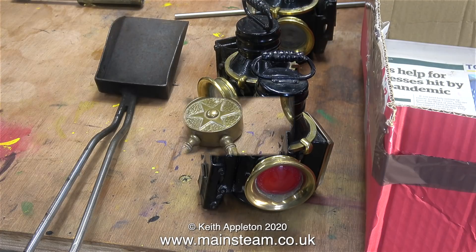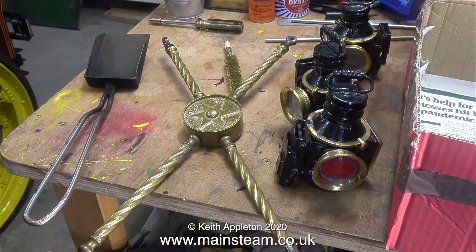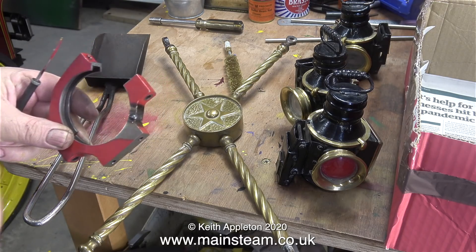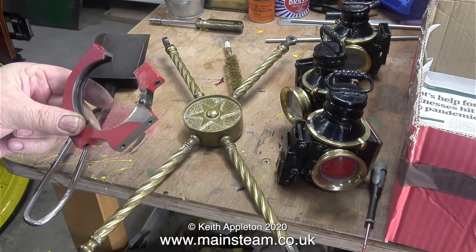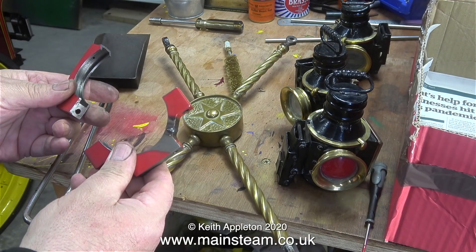I even got a shovel, and this really important part that didn't come with the engine — not the round wire flue brush, which is very good for cleaning the tubes and possibly not too good for treating haemorrhoids, but the fancy brass part with the star in the centre. This part fits in between the two upright supports at the rear of the canopy. Also in the package was a broken eccentric — presumably the water pump eccentric which broke, was welded, and then broke on the other side. So the water pump eccentric, which is unpainted, is a complete new one.